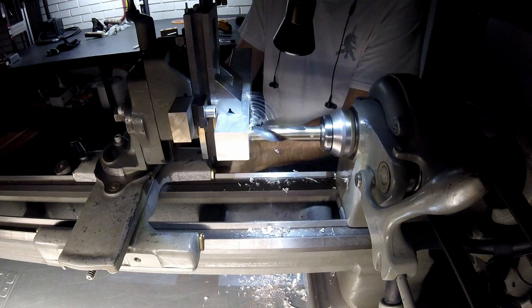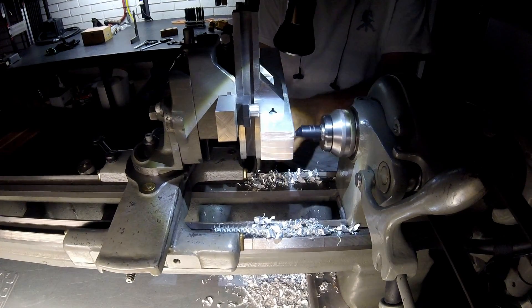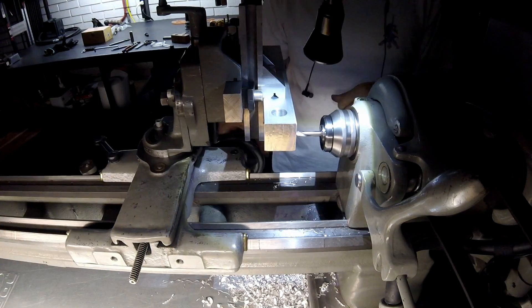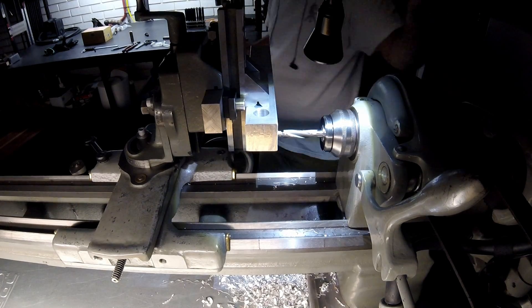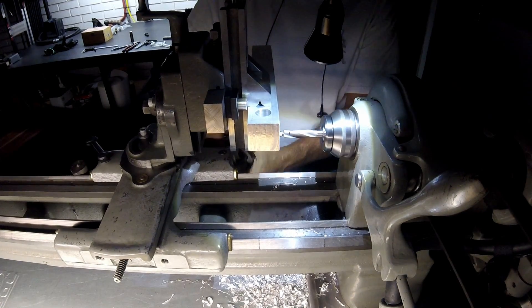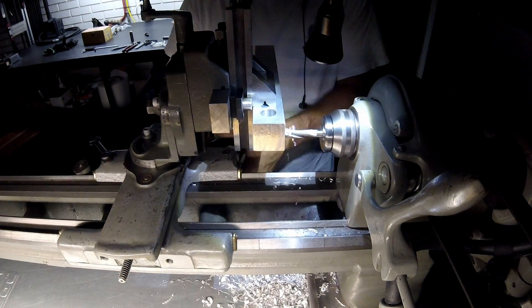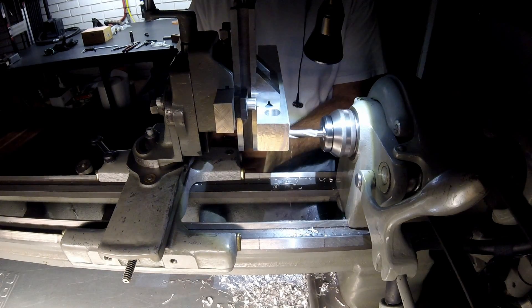This is video from a future video, so I'm not going to talk too much about what I'm doing, but just give you an example of what you can do with it. This is aluminum — obviously not steel — so if it were steel the process would be much slower, or possibly you wouldn't even be able to do it at all. It just depends on what you're trying to do and the material. You have to go slow, but it does work very well, and I would have a hard time getting holes this perfect off of my drill press. You really have to pay attention to your setup — everything has to be tightened down including the gibs. I have additional bolts in the back of the milling attachment as well, and even with that, if I do something the wrong way or apply too much pressure it'll flex. So there is some deflection, and I don't know that you could do this with steel.